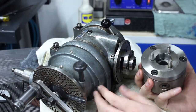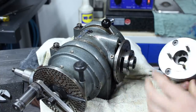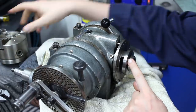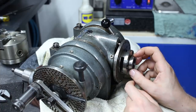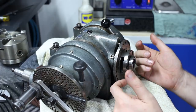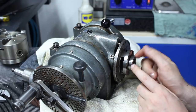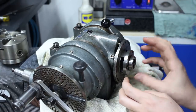It also came with the original Walter Morse Taper 3 chuck with a back plate that fits the spindle nose of this dividing head. The internal taper is Morse Taper 3 and the external taper is a short taper with facial contact, like on a cam lock spindle — same taper, 7 degrees 7 minutes and some seconds, same taper as on my lathe, just smaller.